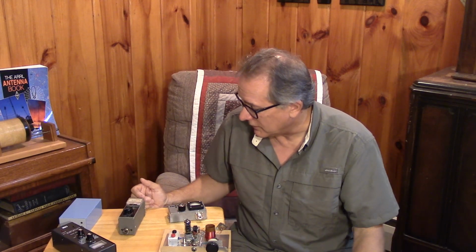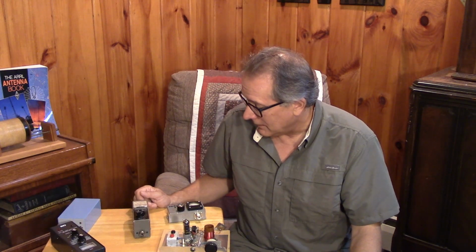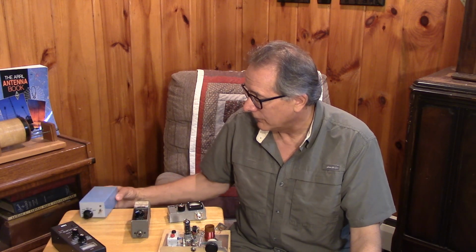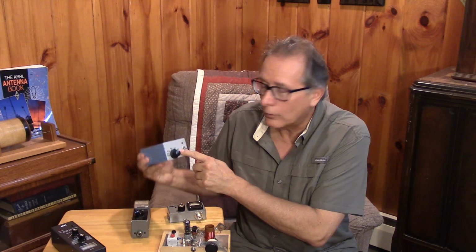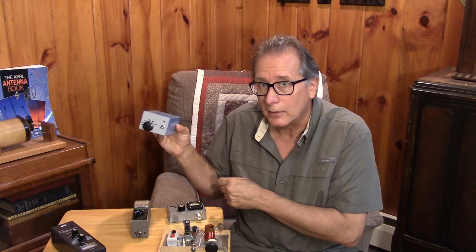So of course it turned into a project which I did not anticipate. I was doing a loop down at the low end of the broadcast band and down to 470 kilohertz for the 630 meter band. I didn't have anything, so I ended up building a little oscillator. This is background stuff. I built this little oscillator and it goes from 400 kilohertz to 1 megahertz.